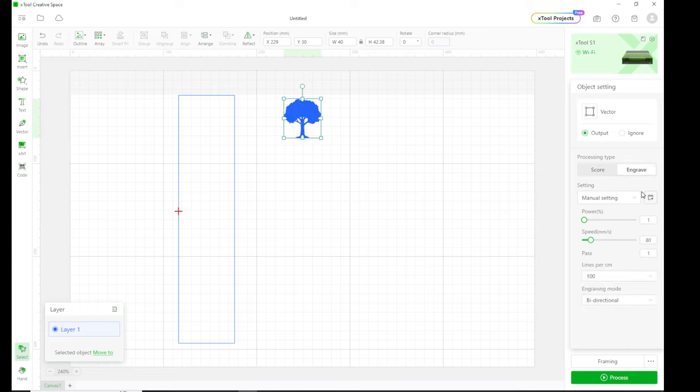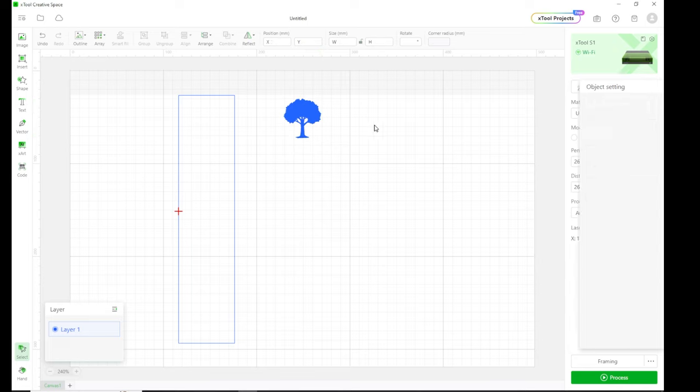I'm going to go to engrave, and I'm going to go here. I've already set up my coated tumblers. I've set a speed up, but since I've done this power test, I want to move that up to 500, because I do know now that at 100%, I can run 500. I've been running 50 at 300, but let's crank it up. So I'm going to run this one at 100% power at 500 millimeters a second.